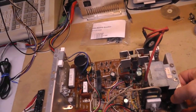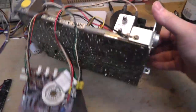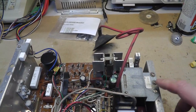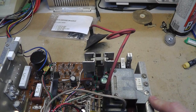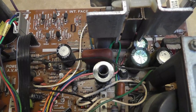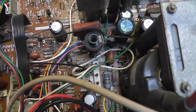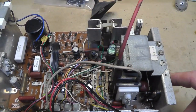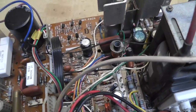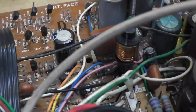Anyway, the way you can usually tell the chassis version, beyond looking at the bottom, you see that's a -37, so that's a little bit earlier. They have like -55s and -40s and stuff. The width coil right there is broken, so you can't adjust it. The core inside there is totally jacked up. It's never been recapped, and if you can see, let me see if I can zoom in on that thing.